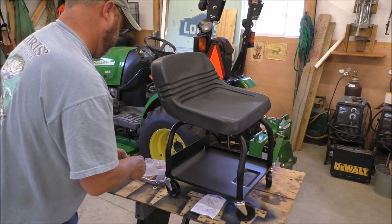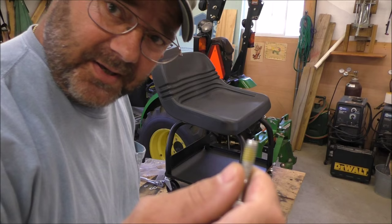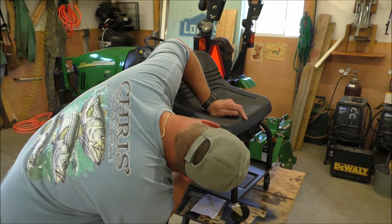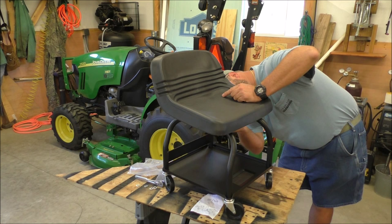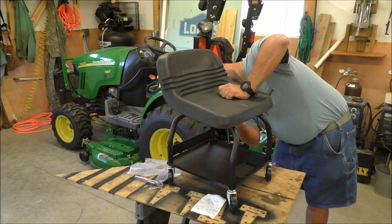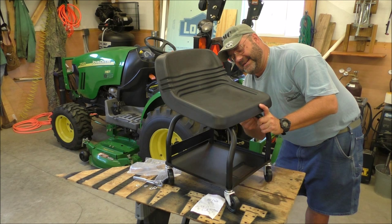There's not enough room for these lock washers. You got Loctite on there. That's all you're going to need. If it comes loose, take it apart, put some more Loctite on it. I mean, that's what I recommend. So, move on to the other side. They say it can either be Loctite or Permatex, whatever's on it, but it's holding. Good.